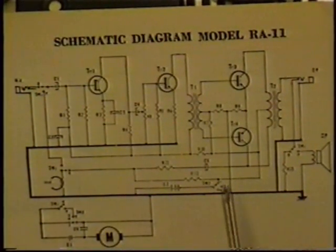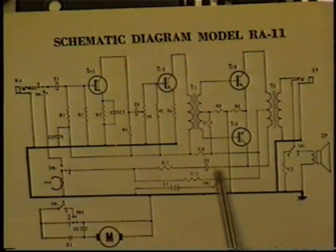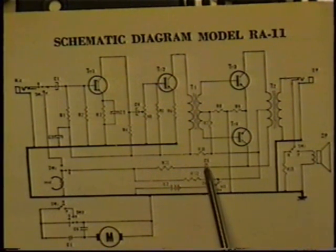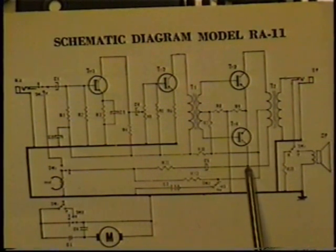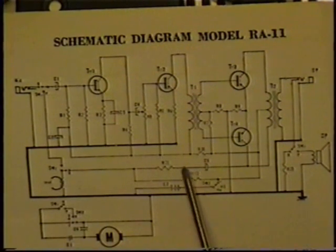But it was leaky in the sense that it allowed a small DC current to flow through the capacitor. It was basically acting as a capacitor in parallel with a resistor. And DC was managing to flow from the amplifier along with the audio through the capacitor and onto the head.